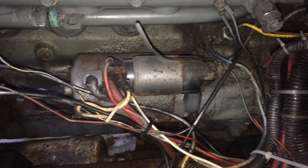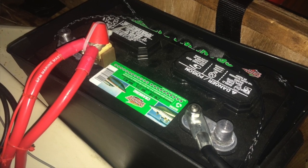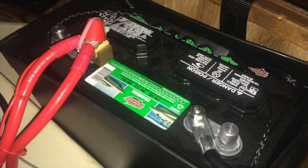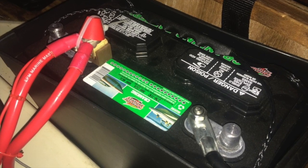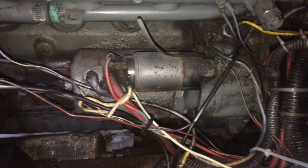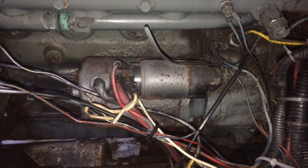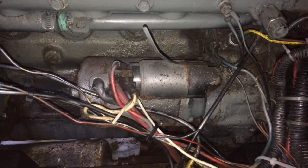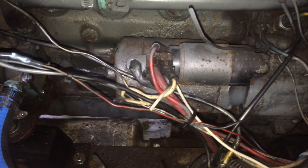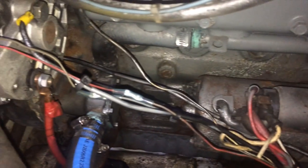What I'm doing now: I just changed out the MRBF on the start battery, thinking that was it. I put a 300 amp on it — the 225 amp didn't look blown, but it's just hard to tell. I started the engine again, it started fine, and the instruments came back up. So it might have been that fuse, but again it just didn't look blown. I'm coming back and tracing everything I can, going to pull the panel off and see if any fuses are there.